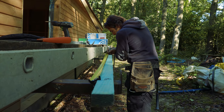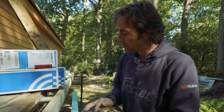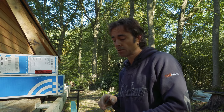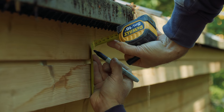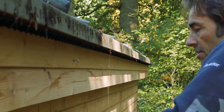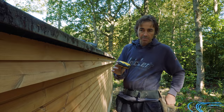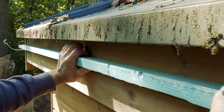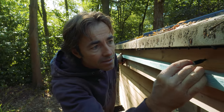This is my rod — basically a bit of roofing batten. I've marked on it the length of the gutter and all my bracket positions. I've come in about 120mm allowing for my verge, and then I'm going 800mm centres all the way through. It's really handy because I can see the relationship between the end of the gutter and each bracket, and the union falls virtually right in the middle of those brackets. That sets my fall. Now we'll put a chalk line all the way up the fascia — not too much chalk, we don't want to leave a big stain. I've got my marks on the rod so I'm not trying to hold a flapping tape measure. It's just simply going along the chalk line adding the brackets — really simple.